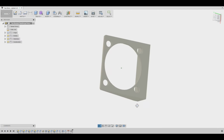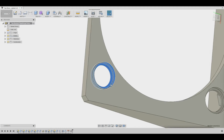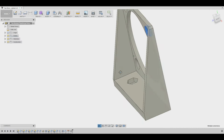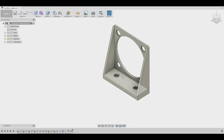I took some rough dimensions from the rubber fan mounts using calipers to dimension the holes. This is not the best way to do it, but since I do not have any information from the supplier, I decided to start with a slightly underdimensioned hole and modify the dimensions as needed. I added 2 ribs on the sides of the part for additional stiffness.